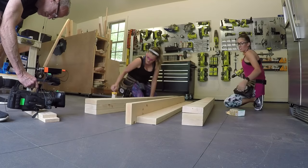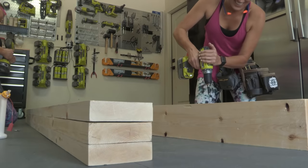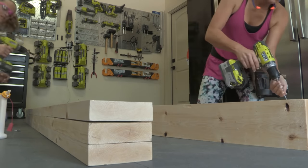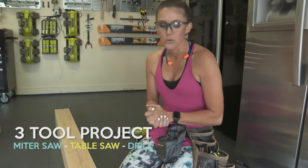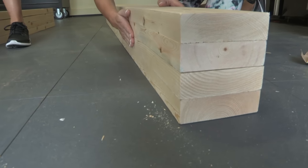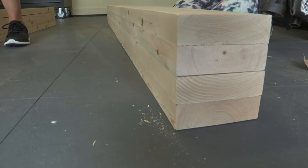I don't want my lounge chair ending up in my neighbor's backyard — or in my swimming pool. So this side of the base is done. You can see we've got all four of these boards sandwiched together. I went ahead and ripped the round edges off the sides using my table saw — that's one of the three tools — and that gives you a really solid-looking side so it looks like one chunky, solid piece of wood.